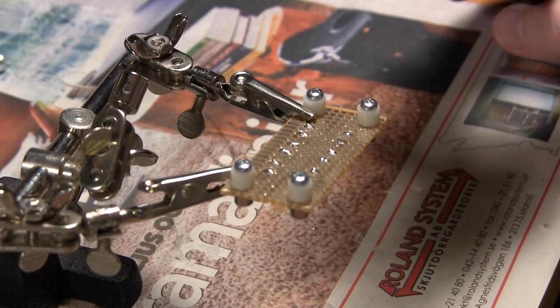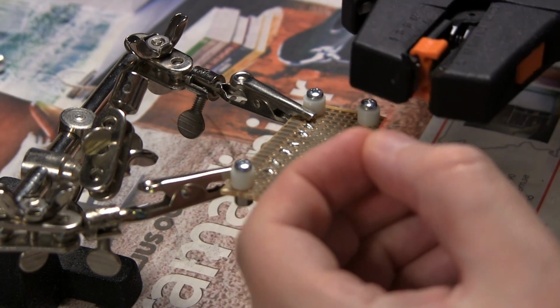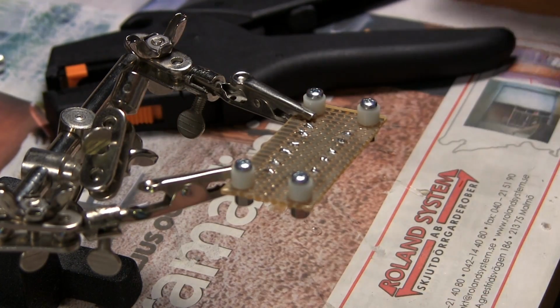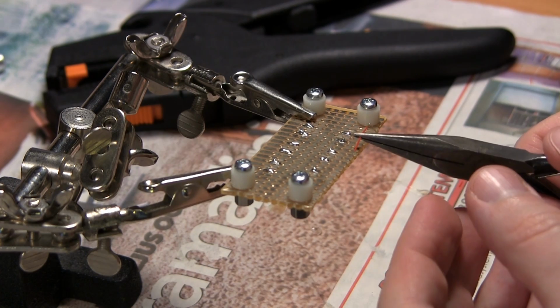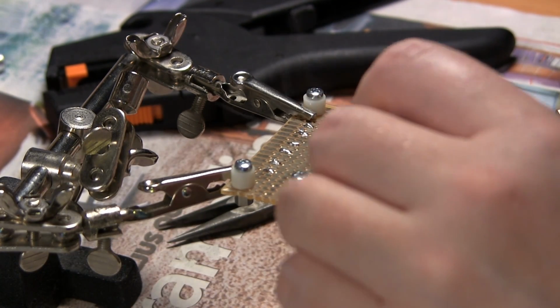for these buttons. So there's a pull down, and then the buttons normally give 0 on the inputs, and when you push them they will give 5 volts.